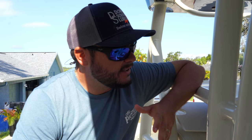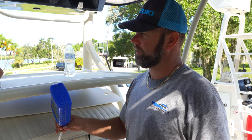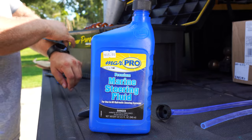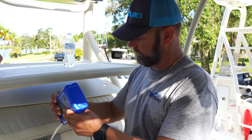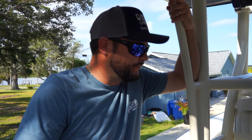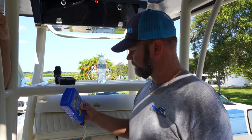Is there really any difference between the hydraulic oils besides price? They all have pretty much the same specs. Sea Star will always say to use their own fluid, and it's probably more expensive. This generic container is $15.95, while Sea Star fluid runs about $32 — so it's definitely not cheap. When you're doing a flush like this you go through three to four quarts of fluid. I've got the system filled up now, so I'm going to flush it all the way to the back to get the rest of the residue and grime out before putting new fluid in.